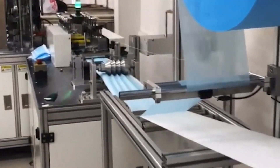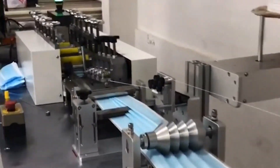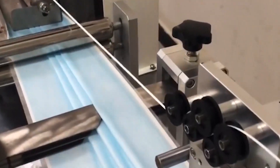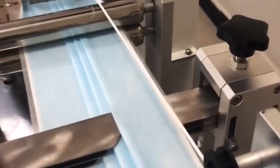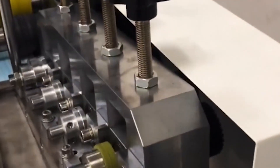To make several layers of masks, just put a few rolls of fabric on the rack. In the path of the fabric, each roll of fabric passes through the tensioning mechanism, and then passes through the fabric roll support frame, and enters the next process. I sorted out the path of the fabric so that it looks very intuitive.